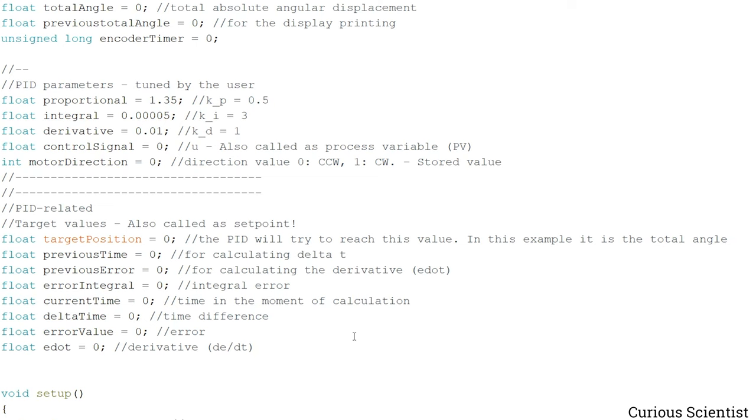I'm not going to explain how the PID works, because I explained it already. And we just apply the exact same principles, but on a stepper motor. So instead of setting the speed and regulating the speed of a DC motor by changing the PWM value of the DC motor driver, here we will change the speed of the stepper motor by sending different speed settings to the stepper motor driver. And this is done basically real time. So yeah, you will see how it works. But I'm not going to explain this part.